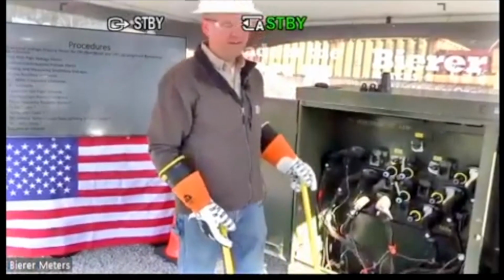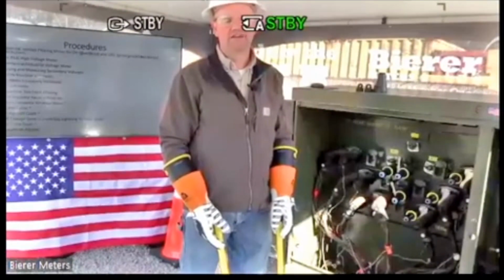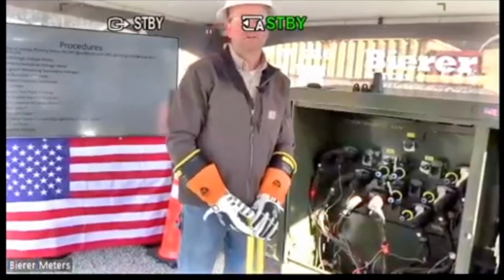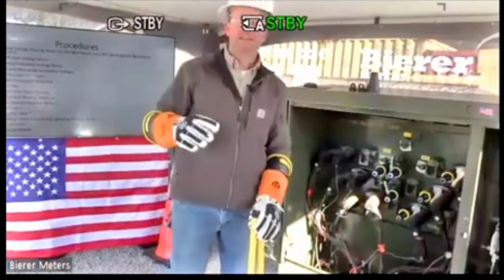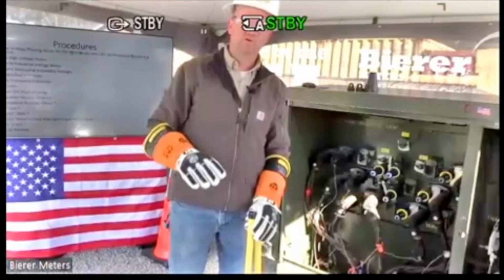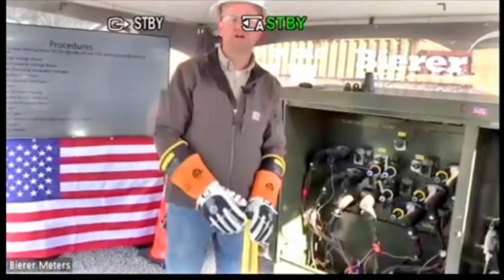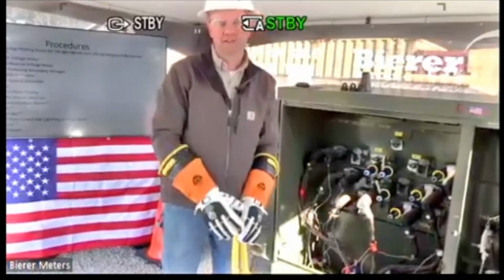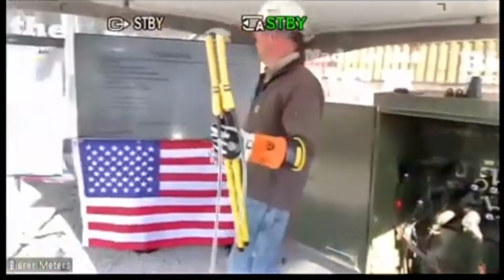You know, obviously we have our phases taped here, so we're obviously cheating a little bit. We know what's in phase and out of phase. But your reading will actually tell you. So your in phase number should be lower than your phase to ground and phase to phase readings. That number should always be lower. So again, you saw your 300-ish, roughly around 300. That number was consistently lower on all 3 phases in phase. Okay, that's your capacitive test point phasing.